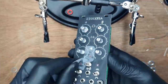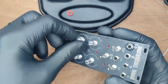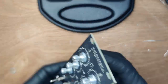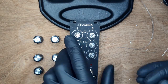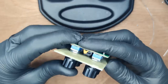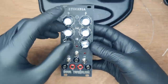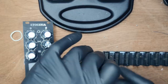Then remove the sticky tape and snip the legs. Give your board a final clean with isopropyl alcohol, then place all of the nuts including the colored banana nuts — black is for inputs, red is for outputs. Now rotate all potentiometers fully counterclockwise. Place the knobs but don't press down yet. When you're sure they're all perfectly aligned, start pressing down with the force of titans. That's it, your Stoicheia is finished. Now do a quick smoke test by attaching your new unit to a power supply.